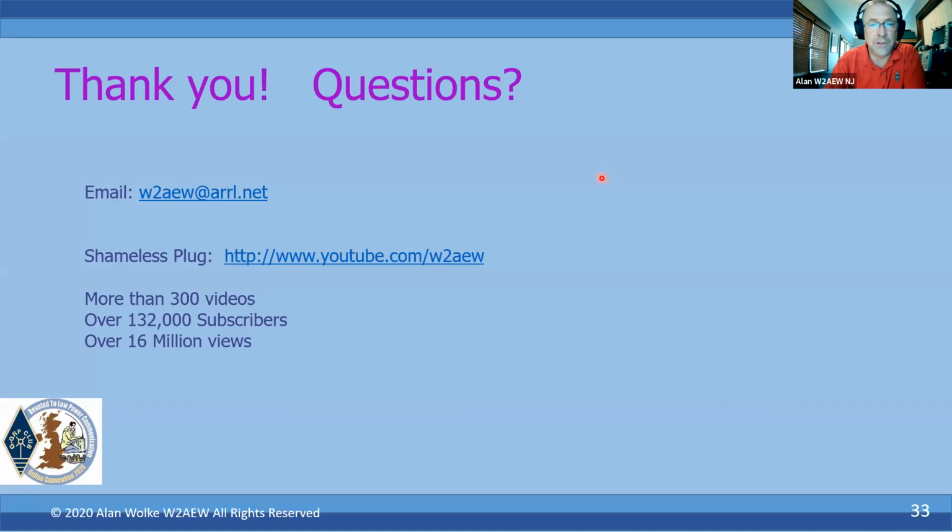From Dave, G7WHI: one thing to keep in mind with using the NanoVNA as a spectrum analyzer is that you will see the reference signal as well as the signal you might be interested in seeing. That's true too. So if you don't have the reference signal connected, you might still get some feed through from that as well. So that will certainly limit the dynamic range with which you can measure.